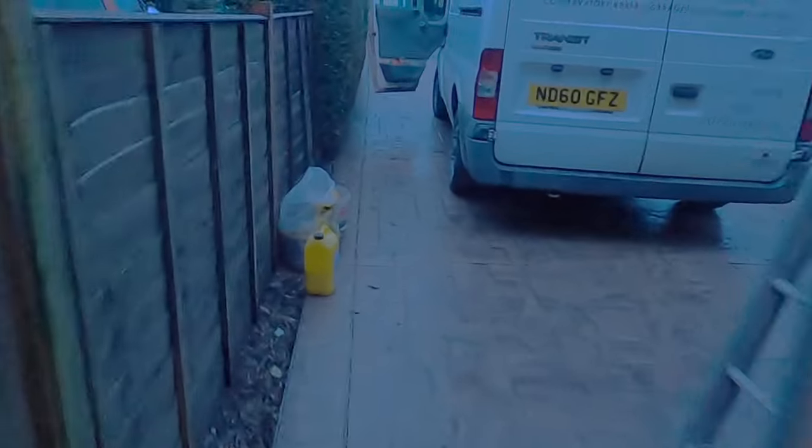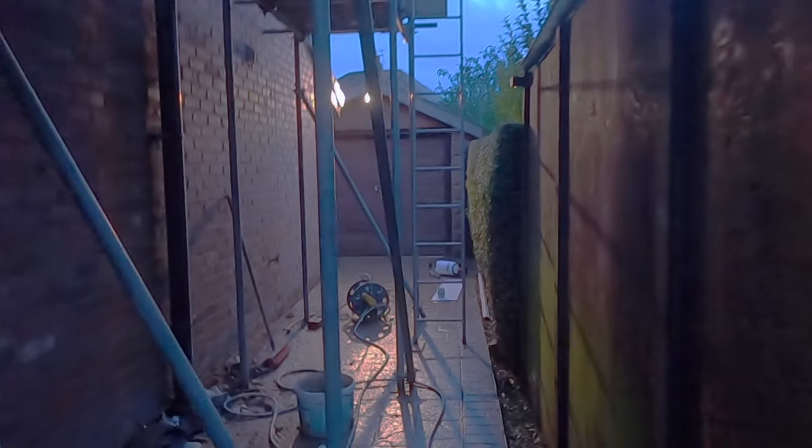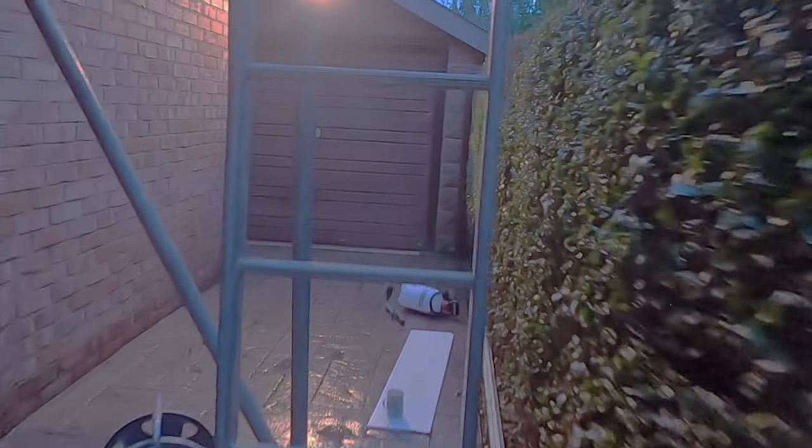With the arch, the window, those two near the sill, and a few other bricks to patch up, so that's all done. So what I'm doing at the moment is weather sealing it, with the very porous bricks and the porous mortar, 3-4-1. I'm just giving it a quick dose with this stuff. It just goes in that sprayer. Just spray it on, soak straight in. Just gives the brickwork that bit of protection because it takes such a lot of weather.